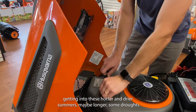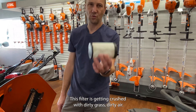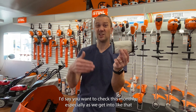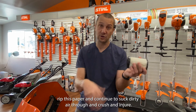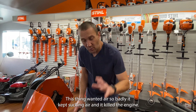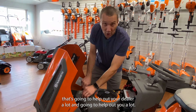This is what we don't want to ignore — this air filter, right under here. Especially as we're getting into hotter and drier summers with more dust and more dead grass, this filter gets crushed with dirty grass and dirty air. Check it monthly, especially in June, July, and August, and replace it annually. The risk is if you don't check it, it builds up, gets so plugged it can rip the paper and continue to suck dirty air through and crush an engine. We just had one come in a couple months ago — this thing was so dirty it killed the engine.